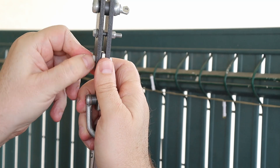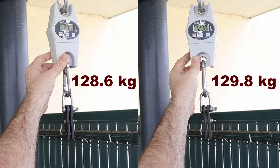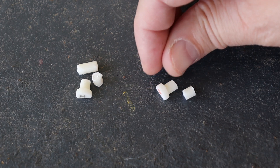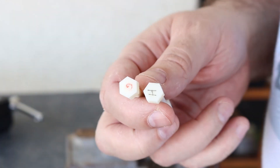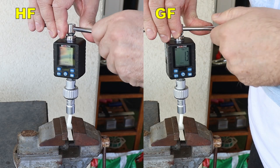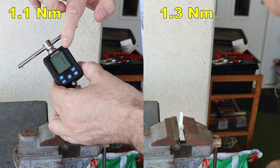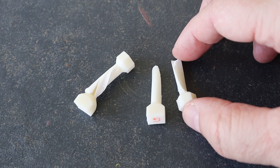Now the shear stress test — side by side HT and glass fiber version. Very equal values here, and they sheared correctly on two cross-section areas. One part is missing though — I couldn't find it. Now the torque or twist test, starting with the HT version. I'm measuring torque at 90-degree angle. The GF broke quite early, so it is more rigid. Here you can see how they look after this test.